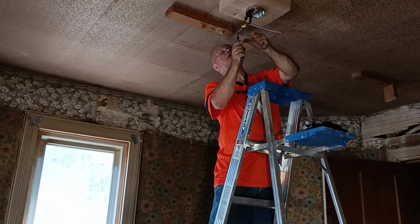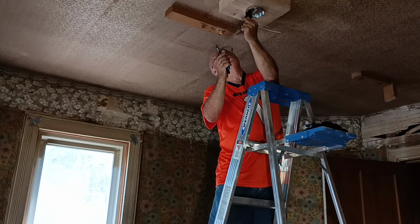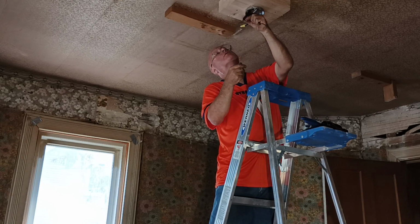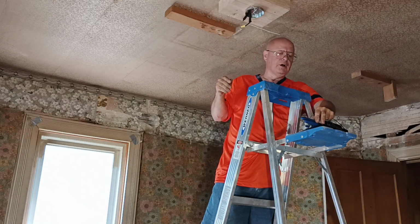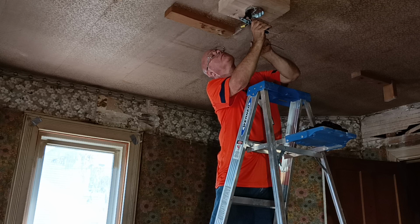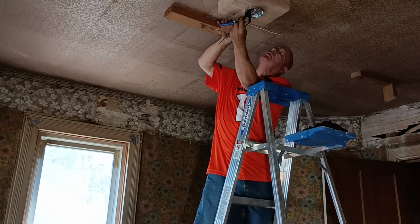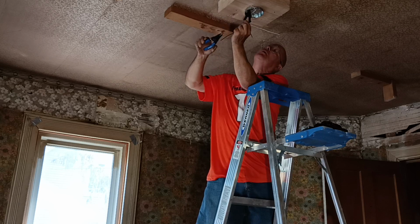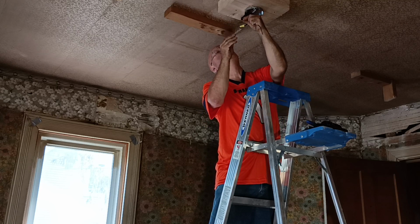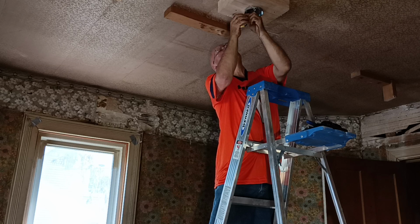This is the hot wire, the black one. And we'll take a little off here. Alright, so I'll get an even insulation. Okay, I'll take a little more off. Okay, get the copper even at the bottom, the insulation even at the top. Push that wire nut down here. So you can push that up a little bit.